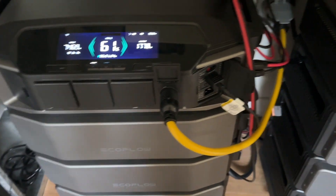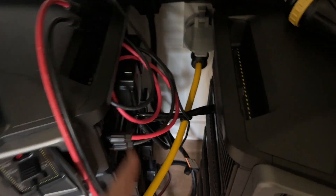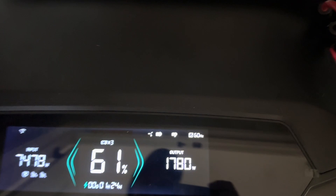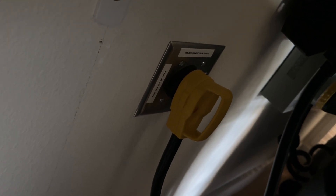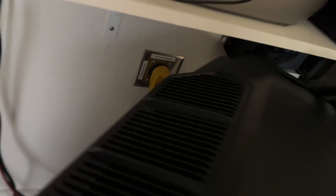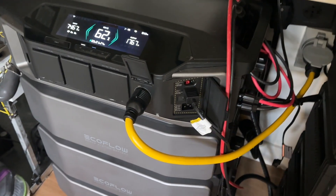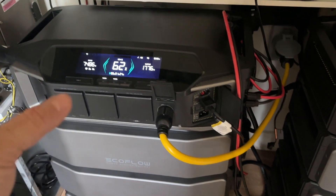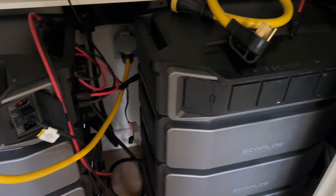This is the perfect little backup power solution I could come up with, fully DIY. I have some solar tidying to do over here — this goes into my panel upstairs. Instead of having a huge cord on the floor, the thing the generator's plugged into out there in the wall runs to this right here. So all the generator's doing is essentially feeding a 240-volt outlet inside the house, and then the EcoFlow can plug into that and power the house. This is basically the same setup you probably have on an interlock, except you're inserting the EcoFlow Ultra between the generator and the interlock, so you can sip power when you don't need it and don't have to hear that thing running all night during an extended power outage.